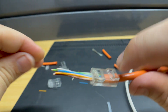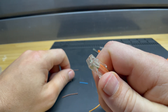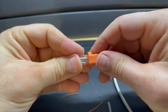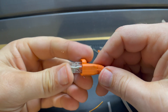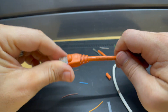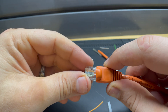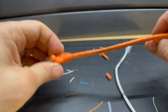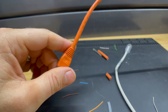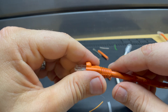Then trim off the excess wires that are sticking through — traditional wire cutters work for this. Once you clean that up and get those wires cut, it should look something like that. Slide the strain relief boot back on and there you go. Obviously the next thing you want to do is test the cable. I have a video on how to test RJ45 cables — I'll put that in the description. You can also plug it into a computer and make sure you're getting the correct speeds, which is a cheap way to test it.